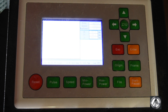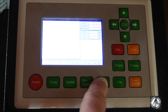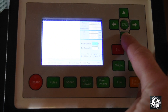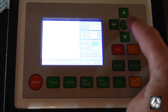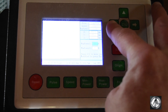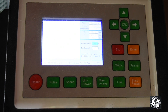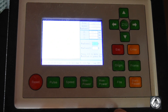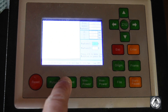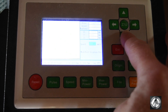Now that you have your ramp set up and your nozzle head just barely touching the material, you're going to go back to your controller and set your max power. For mine, my laser does not fire anything under 10%, but to do your ramp test, let's set your max power to 25%. Now for the speed, let's set it to 200.